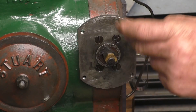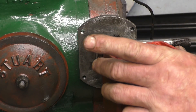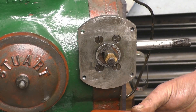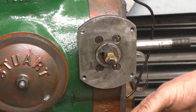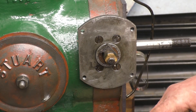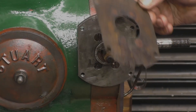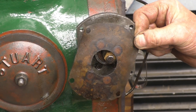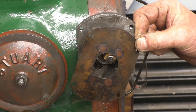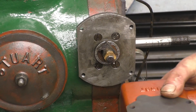It doesn't need a gasket between there and there because there's an oil seal in there — I don't think anyway. Was there a gasket on there? There should be, because there's oil in here and the oil will piss out between that and that. So I'll have to make a gasket for it — unless I already made one. Right, that answers the question: it does need a joint and I haven't made one, so I'll quickly make a joint to go around there.